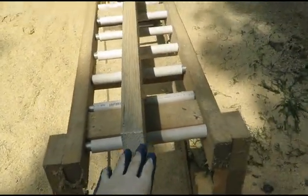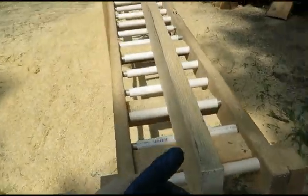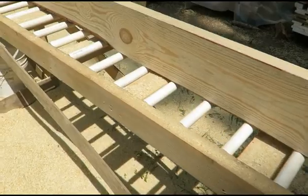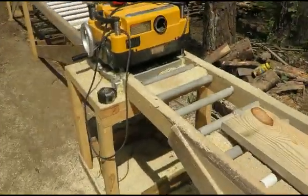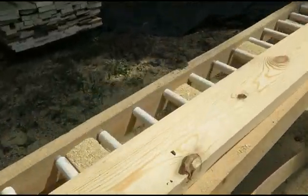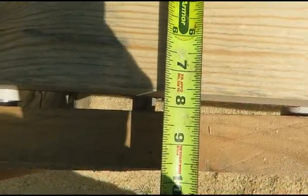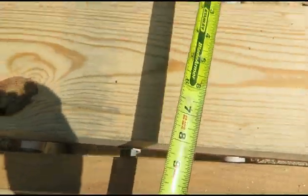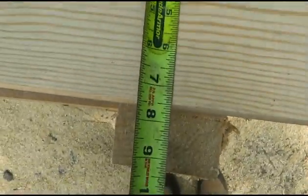Now again, I know that this will have to be run through for overall thickness, or width, because of the way that the Woodland Mills cuts the lumber, you could be out 1/16 of an inch or whatnot, which is not a lot in framing lumber. But you can see here, this is running about 7 5/8. That's been average 7 5/8. Down here I'm at about 7 1/2.